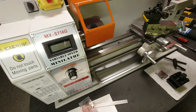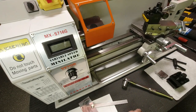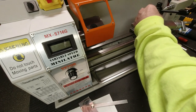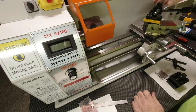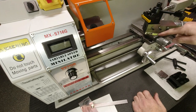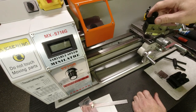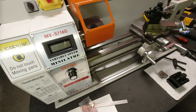None of the wrenches that came with the kit will loosen this so I can move it around, whether I have two different cutters or need to adjust it. It's almost easier to adjust this than to adjust the compound, because adjusting that means sliding back, loosening two hex bolts, then adjusting the saddle or carriage. So it might be easier to just maneuver this and tighten it down. More learning — definitely more to come.